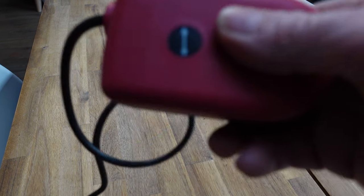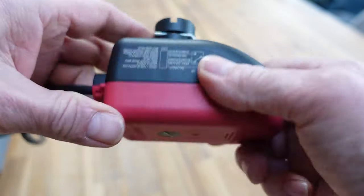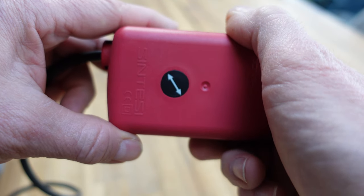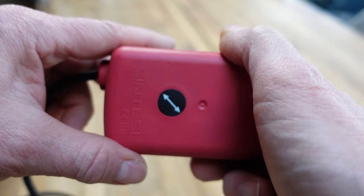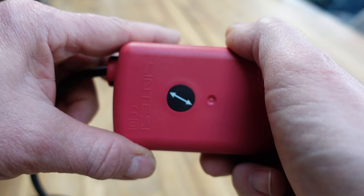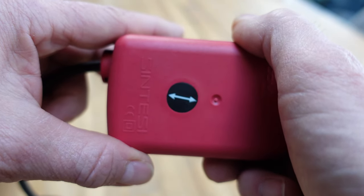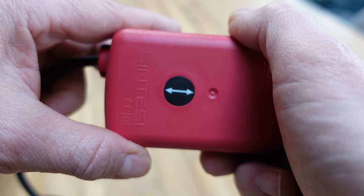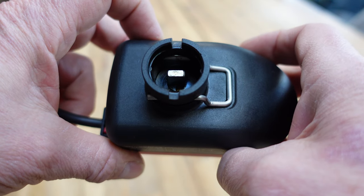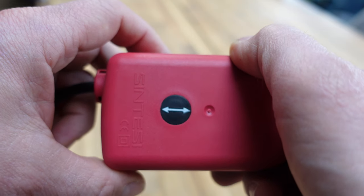I'm just going to switch it on now. We can see that the valve is moving — it's not a very quick valve, and that's a good thing for heat pumps because we don't get hydraulic shock from going from one port to the other. So that's gone to hot water mode now — the three port valve has moved 90 degrees.